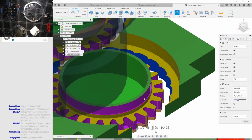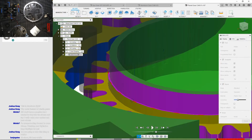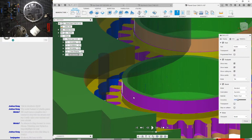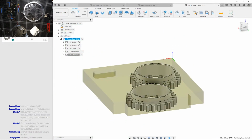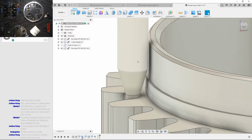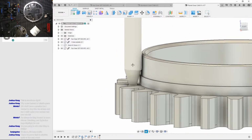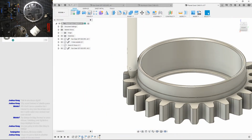Collision 32. What happens here? Okay, you can see where it's swinging right here. That's where I'm hitting the tool. I should be fine. The tool's shaped differently. I can even check that. We also save. Nope. Where is it? There. Yeah, see, it's not gonna hit. I designed the whole end mill here too. Should be fine.